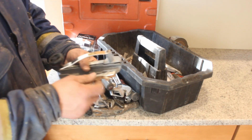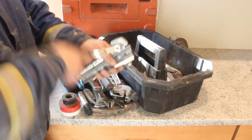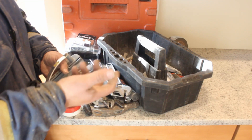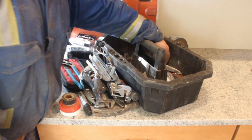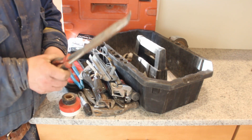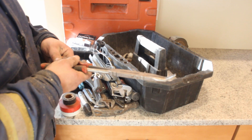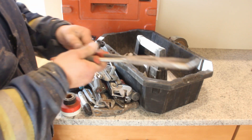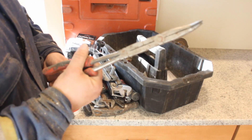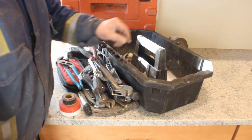A rotostripper for cutting armored cable, BX cable, MC cable. You just put your wire in there, spin it — you don't have to hacksaw it, and you don't get a nasty edge like you would cutting with a pair of dikes. Nice tool. Long needle nose pliers — sometimes you're sneaking into the walls through a single-gang box hole and you can reach in and grab the wire you're trying to pull down. Or if you're trying to find a wire in the wall, you can grab it off to the side, or pull it into an old work box. It gives you extra reach for alarm wires, regular wires, things like that.